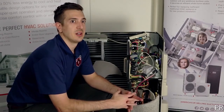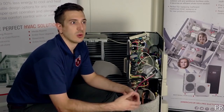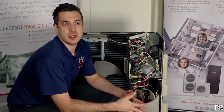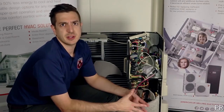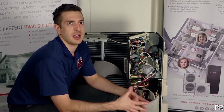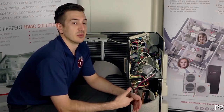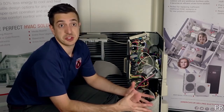One of the biggest problems that we find is when the formation of rust or corrosion occurs between the LEV coil and the body. We typically see this on oceanfront properties or somewhere near the ocean. When the LEV coil starts to condensate or sweat, it will eventually rust. When it develops this rust or corrosion, it interferes with the magnetic field that's trying to open or close the refrigerant, leading to either a refrigerant error or some type of restriction.